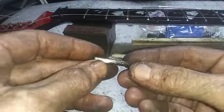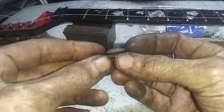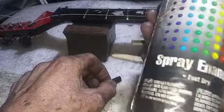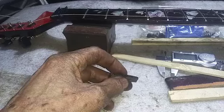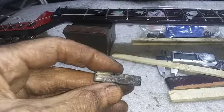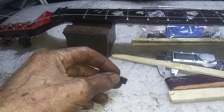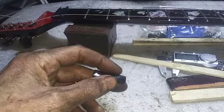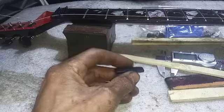Well, it took a while, but I finally managed to get a gloss black finish on the spacer for the neck. First I tried dipping it in this stuff, the black enamel spray paint, but it was awfully thin and it didn't seem to be sticking real well. You can see at the bottom here it still didn't really get well coated. And then I tried black lacquer and kind of got the same effect. It sort of ran right off again. So then I tried the flat black paint that I use on a lot of the builds, and that worked.